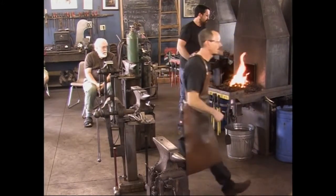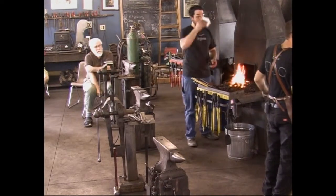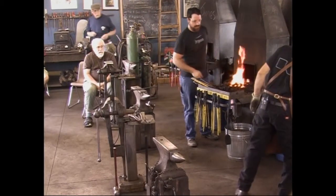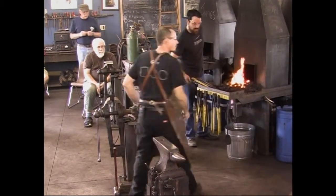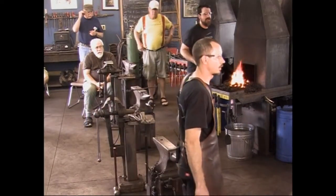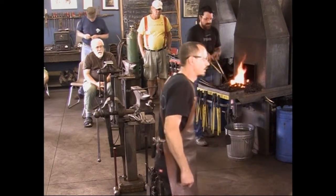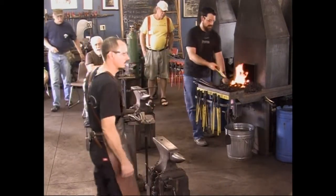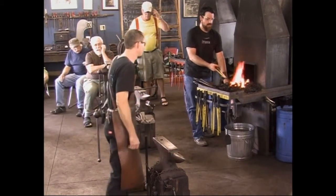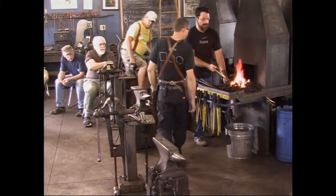When you side butcher like you're doing, I wonder if that would really help. Probably would help. So far, I don't have any complaints with this one in the power hammer. But like this, it's a little tough. You actually slant the top of the butcher so you were hitting right over the cutting edge of the butcher instead of hitting flat. And here the force would be going more straight down. Just tilting the sledgehammer in on it. I don't know. There's a sweet spot in that tool I need to hit. I found it.